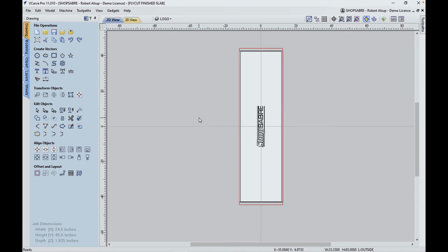What we typically do is put the surface up that rocks the least, and then put boards around the outside that are held down with vacuum, and that keeps it from moving around until we establish the first flat plane. Well, the block that you see here is actually the blank, and then this red line, I've made it larger. This is what we use for actually creating the fly cut tool path, and I've made it longer on both ends so that it leaves it smoother. We don't have the cross marks coming across here because eventually we're going to have to sand that out. So that's what this one does.